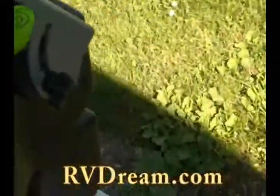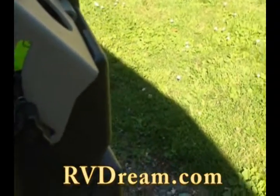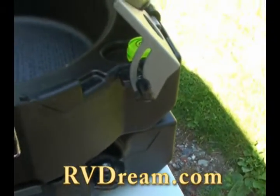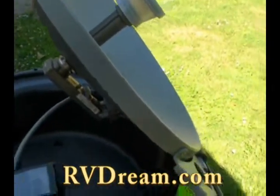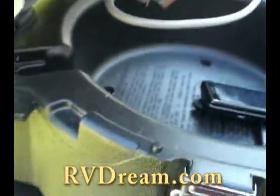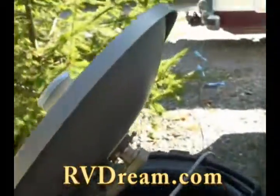What we have to do first is set the tilt. Here you'll see the tilt indicator on the side — we have it set for the prescribed 37 degrees. You just unscrew this little thing right here and you can move the satellite dish up and down until you get it, then screw it back in and lock it on both sides. So you've got the tilt set, and tilt is very important — it can change everything.